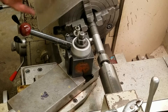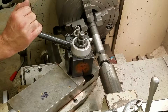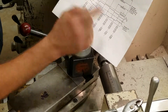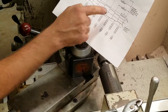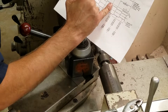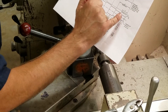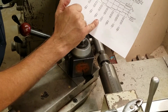In this video we're going to look at how to turn our part down to diameter and length. We're making this step bar — right now sticking out about five inches. We're going to cut back about four and a half inches: four steps, one inch long. Four and a half is going to take us to here, so we want to overshoot this one. Always start with the largest diameter first, then the next largest, and so on. We're going to take this big diameter first and take it down to 1.125.